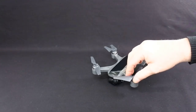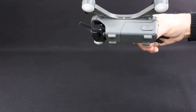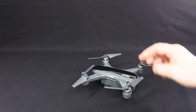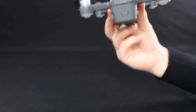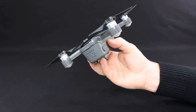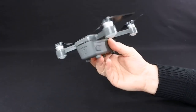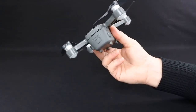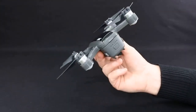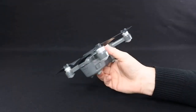I doubt very much whether I'll get another one, because if it's got this issue from the start it could have this issue all the time. I must say the battery arrived completely flat, which is another bad sign - they're sending these out with flat batteries. Bear in mind you shouldn't go below 3.2 volts per cell, so this should have had 9.6 volts at the very minimum. It was under 9 volts when I got it - I measured it with a multimeter - so you need to be aware of that.